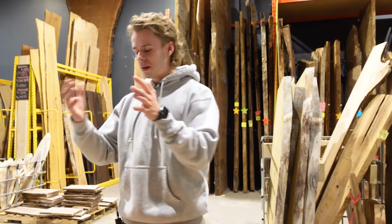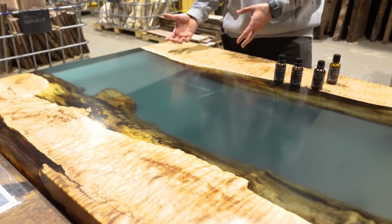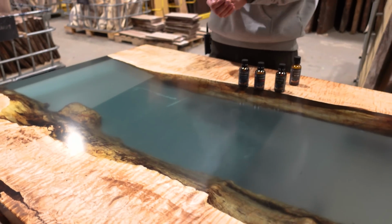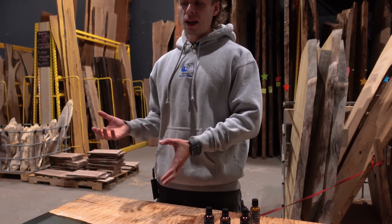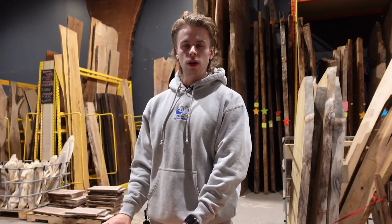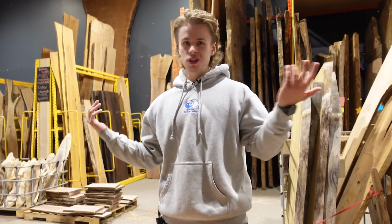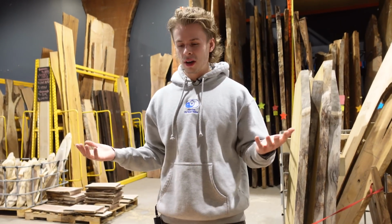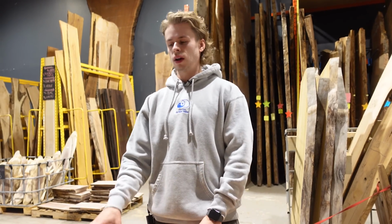It also ends up being more compatible with the oil finishes that people are typically putting on their tables before applying the ceramic, because like I said, a solvent-based coating can actually end up stripping away the protective oil that you've applied to this table first, whereas with a water-based coating, the oil's just going to repel that water, the water's going to evaporate right off, and you're only going to be left with the graphene protective coating on your table.